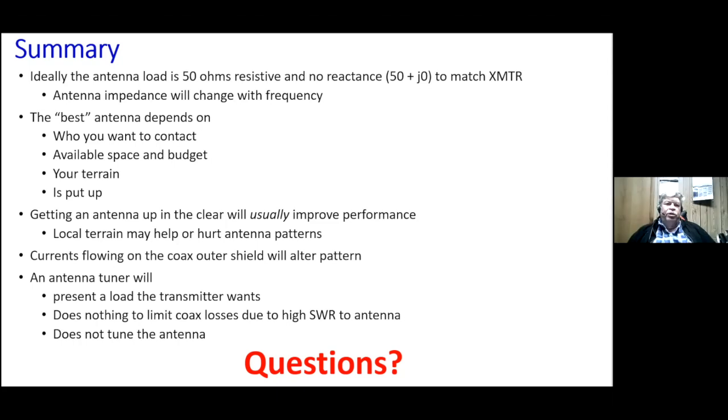And by efficiency, you're looking for maximum gain. If you wanted a fixed antenna that radiated in all directions, you wouldn't necessarily want the gain. But you could lose some. You don't want to make your antenna out of nichrome wire, because the currents flowing are just going to get converted to heat. So if you use a good conductor and wider conductors, you'll have less losses from that standpoint.